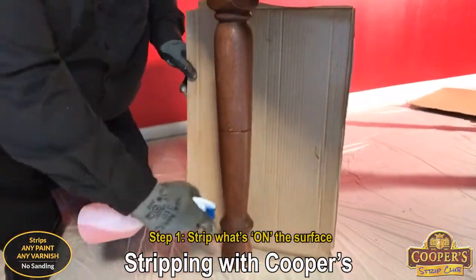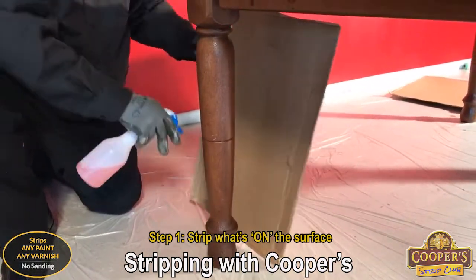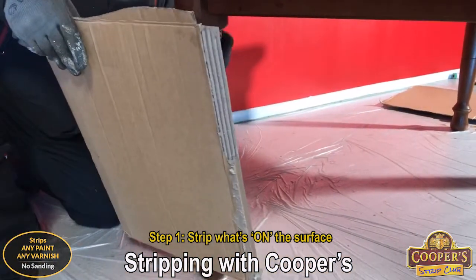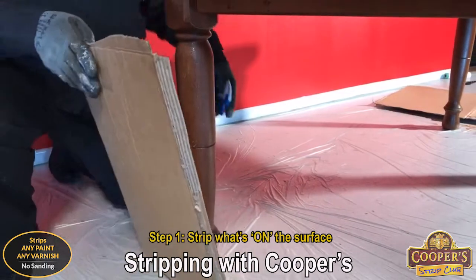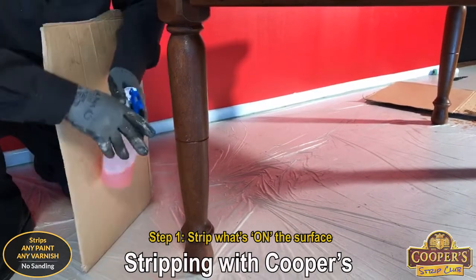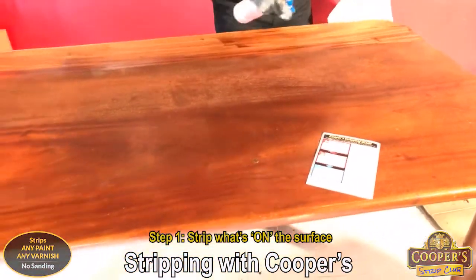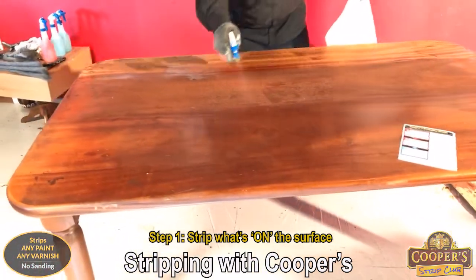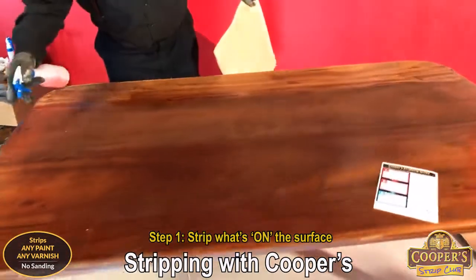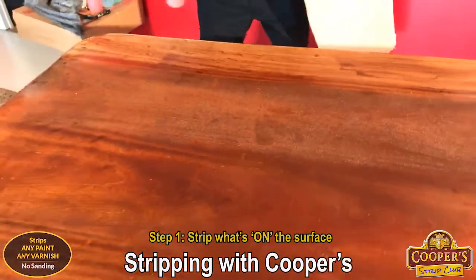See I've got this shield — just a fan-shape spray. We're often asked can you brush it, which yes you can, but I just don't like brushing because it takes too much time and it's really difficult to brush over the top of the first coat of stripper. Now two or three light coats of stripper does not use a lot of product. This table totally — which is a big table — will use somewhere between one or two litres for the whole job.